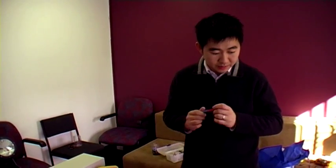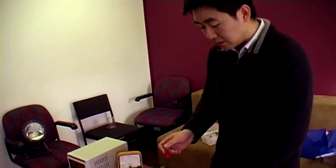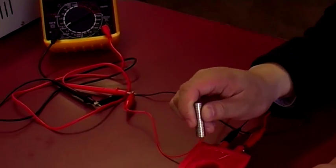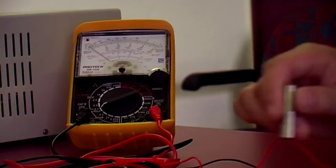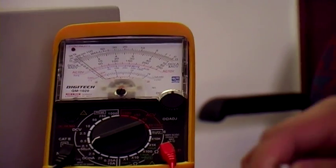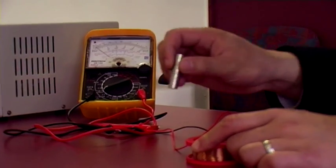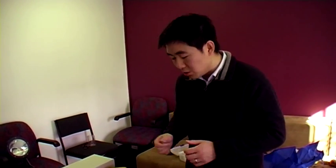The first thing we're going to test is the distance between the coil and the magnet. Obviously, you would think that the further the magnet is from the coil, the less current is produced. Using the stronger magnet: if I move it from far away, you can still see the needle wiggle, but it stops when the magnet stops. Moving closer to the coil, the wiggle is now bigger. Moving away, the wiggle is tiny. So distance is inversely proportional to the amount of EMF induced in this setup.